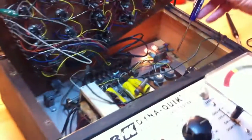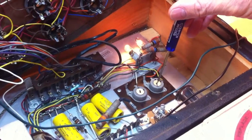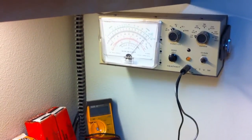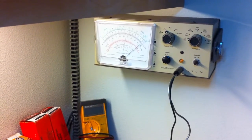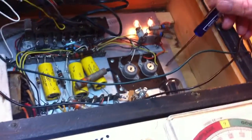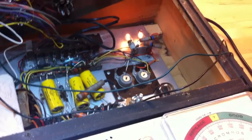In order to do that we're going to need a screwdriver. As I make an adjustment here we can see the change happening over here on the vacuum tube voltmeter. We want this adjusted to one and a half volts. That is R14 — the pot number. The one next to it is R9.